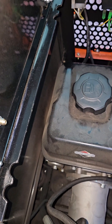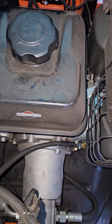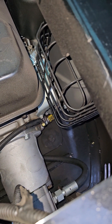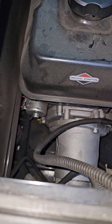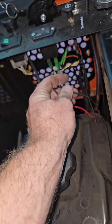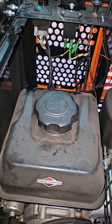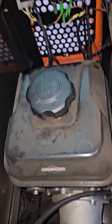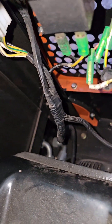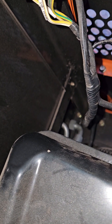Here's your Briggs motor. It is extremely loud inside the cab — I'm going to look at changing the muffler to see if I can find a better one. You cannot operate this thing without wearing some type of hearing protection right now. You've got your oil dipsticks down there — you can see that yellow cap. There's also your starter, your fuel tank, and some cheesy wiring; none of the wiring on here is good. There are two extra wires for a hydraulic fan, so I'm going to be adding a hydraulic fan — I might put two in if I can find room. I'm probably going to put a hydraulic filter in here too. There's the reservoir down there — the top line will be your return line on hydraulics; unless someone put it together wrong, the top's always your return.